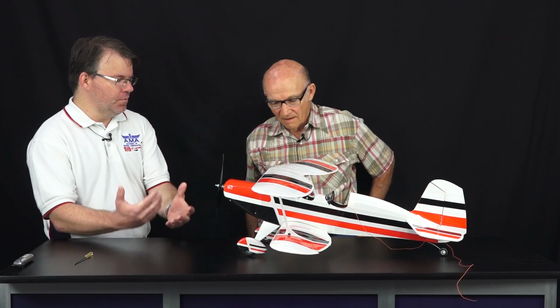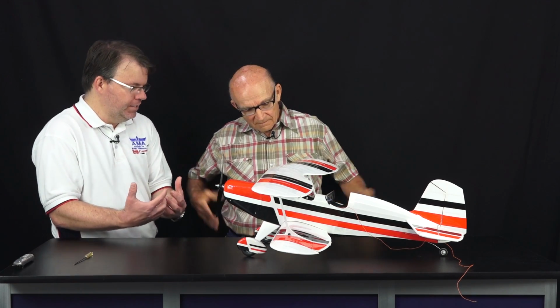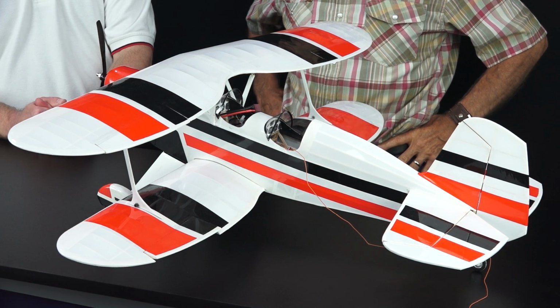So tell us a little bit about the flight characteristics for someone that wants to build this, and obviously there's that nervousness about that first flight because you built it. So tell us what to expect. What did you experience? The only problem that it had, and it wasn't a problem, was that when I did the first loop, it looked more like a 12-sided loop because I had too much elevator throw. So that's been geared down. It's on the plan like it should be. But other than that, it's rock solid in the sky and everything.